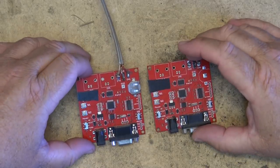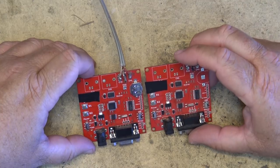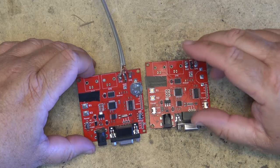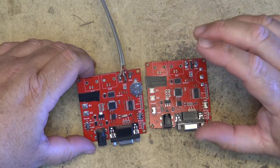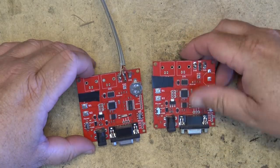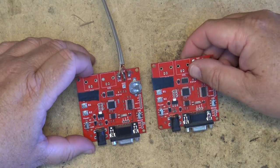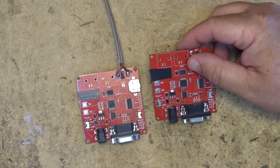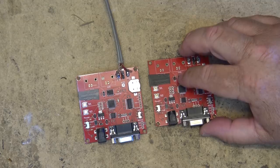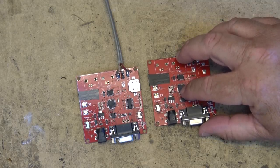I've got here two identical boards. What these are, an XY oscilloscope clock board. You've seen on my opening logo, when I show a shot of the time on my scope, was generated by one of these boards. Both of them have failed. I blew up one working on a scope that I was trying to interface it to, and had a short, and I'm pretty sure I popped the AD converter, or DA converter, I should say. This is the Atmel, I know it works.